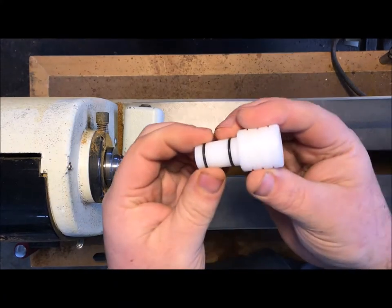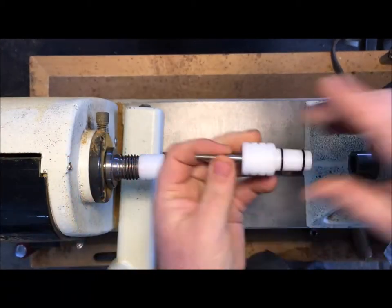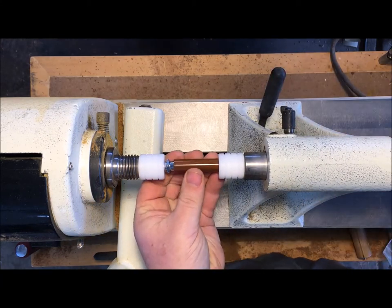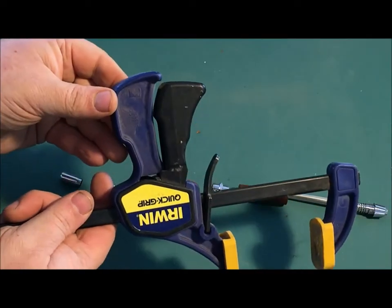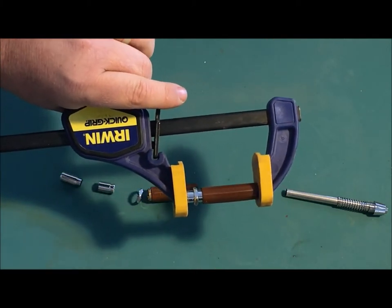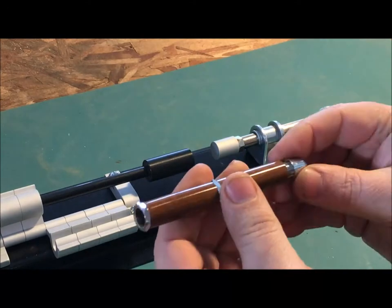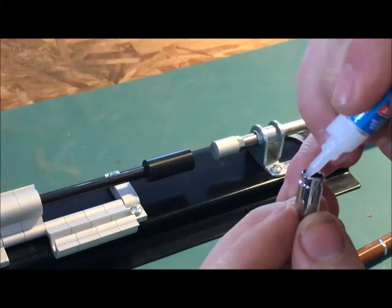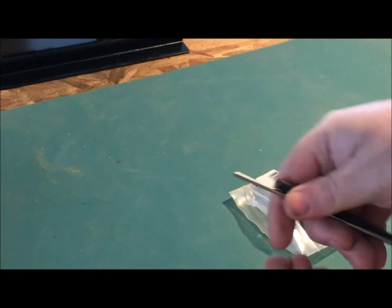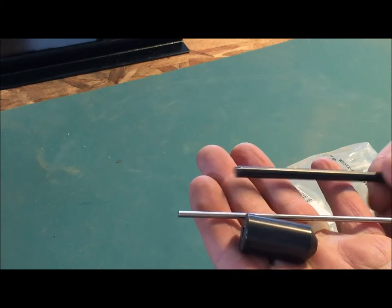Now that you've got the pen polished the way you like, you need to assemble your parts. There are many different ways you can do this — there are tools you can get to turn your lathe into a pen press, and I've seen resourceful woodturners make their own wood parts to press pens on the lathe. You can also use a vise or a clamp, just make sure you don't use anything that's going to mar up the metal surfaces on your pen. If you're going to be doing any production, a pen press is where it's at — this one is the Miles Craft brand and you can pick it up for about $45 or $50. One last helpful tool, just in case you need it: a pen disassembly kit for when you mess up, like I do frequently.